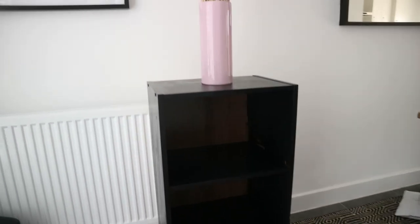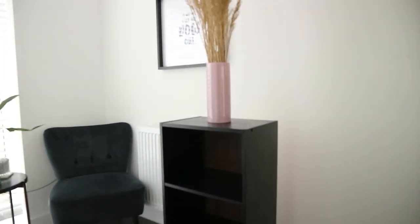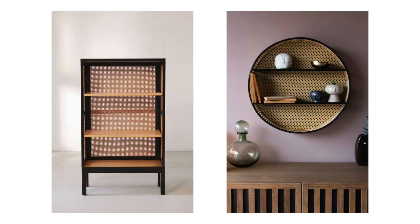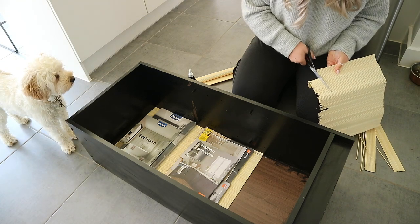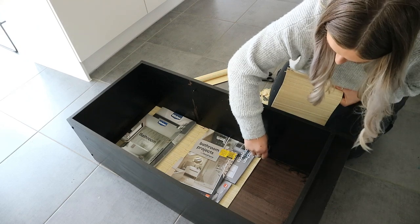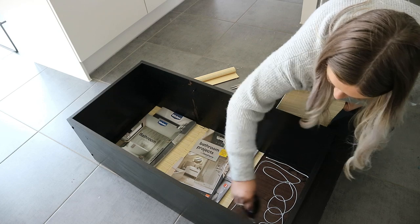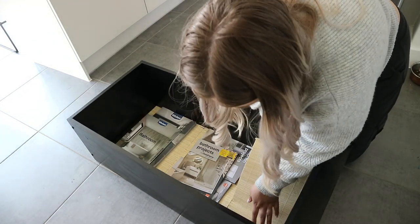This is what it was looking like when all dry — as you can see the back panel hasn't been painted, and I'll show you why. I also had this vase with some dry grass I picked the other day and wanted to do something with that too. I noticed there's a lot of rattan cane style stuff going around, so I wanted to do something in that style. I did look at rolls of woven cane but it was quite expensive, so I found bamboo placemats on Amazon — £8.54 for four placemats. All I did was cut them to size and used no-nails wood glue from a previous project to glue them to the back panel of the bookcase.